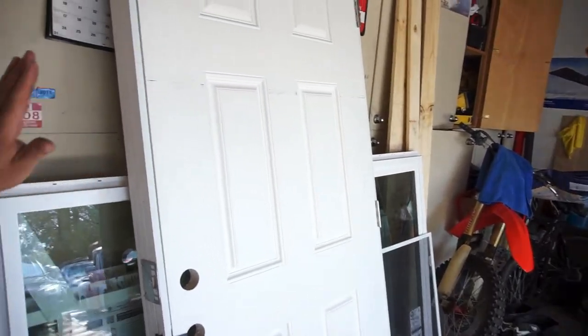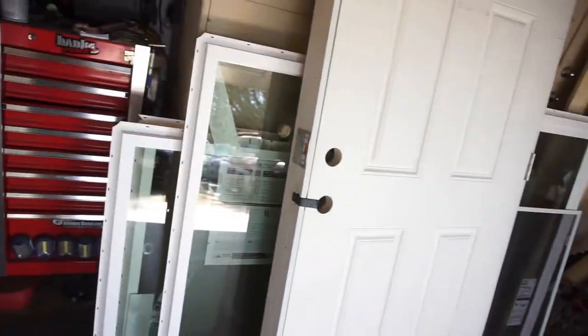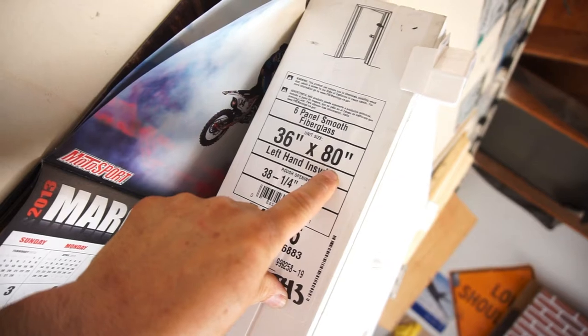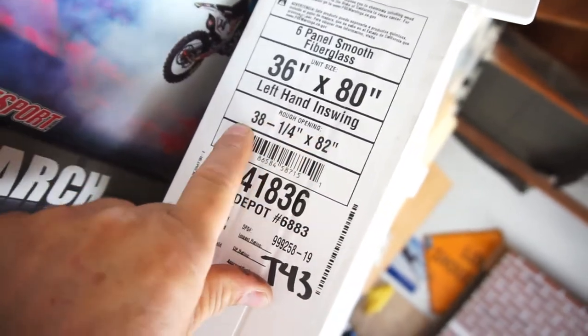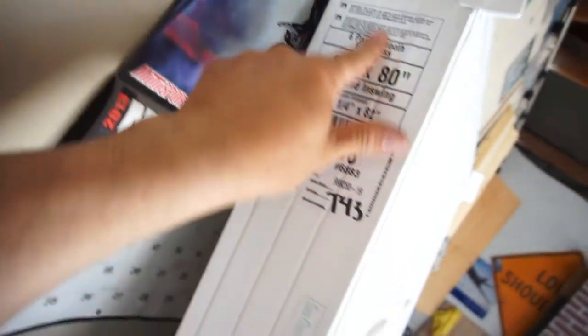For now I think I'm just going to go install this door — door shouldn't be that hard, as long as they didn't make some weird custom stupid size and cut the bottom of the door. I've seen contractors frame it to an exact six-foot or three-foot opening: three-oh-six-eight is a three-foot-wide, 80-inch-tall door — six foot is 72 inches plus eight inches. But the rough opening is 82 inches, so it's usually two inches bigger on the doors — rough opening 38 and a quarter by 82. Left-hand swing, in-swing door. Anyway, this is what I'm going to install; I'll show you guys when I'm done. Stay tuned for the next video — got some pretty cool stuff. See you guys in the next one, thanks for watching, subscribe.